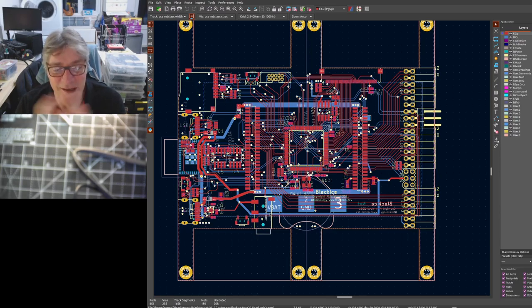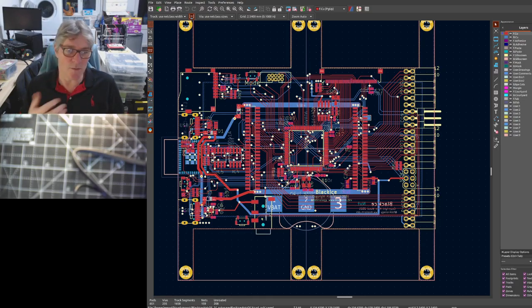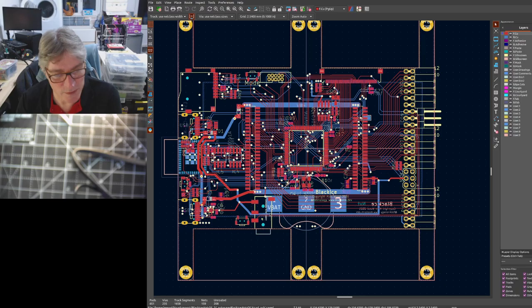But what can we do? And I did look at European sourcing, American sourcing. And for longer boards, I can get them, but it's tricky doing the ICE Logic Bus, the ILB board. The specs on that are quite high. And even though some people can do it, the trouble is, once you do it for a different manufacturer, it's not proof when you want to then order hundreds of the boards. You want to do your prototype for the same manufacturers, so that you know it's going to work and you don't hit any new problems, so you actually troubleshoot the manufacturing at the same time.